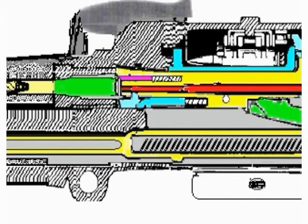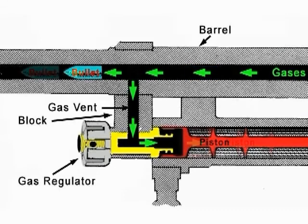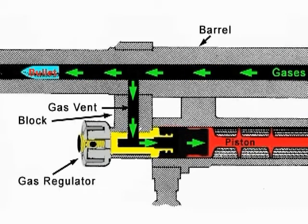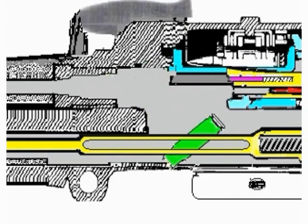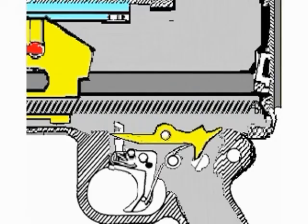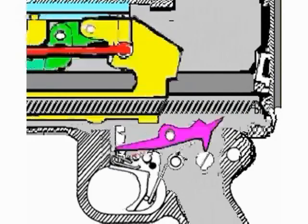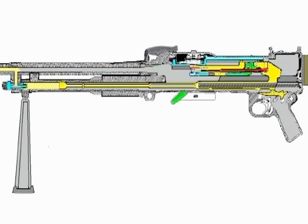During the primary movement of the piston, when the breech is still locked, the bullet travels from the gas vent to the muzzle. The breech block, being jerked slightly, is enough to affect the primary extraction of the empty casing. When the breech is fully unlocked and the breech block starts its rearward movement, the extractor withdraws the empty casing from the chamber. The ejector forces it from the face of the breech block out through the ejection slot. The working parts continue to the rear and the return spring is compressed.